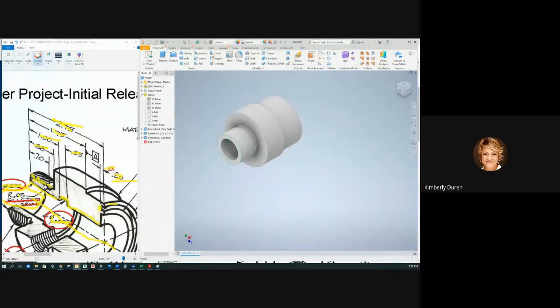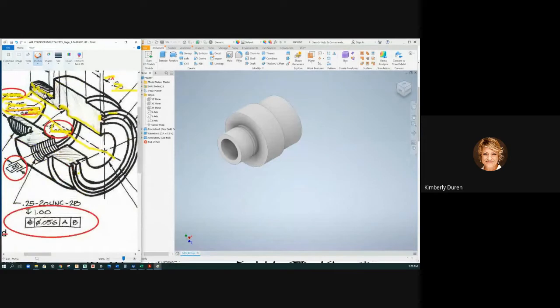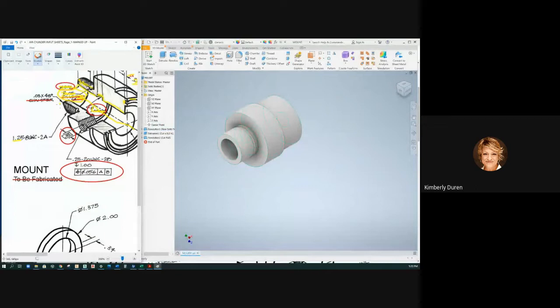Okay. So we've gotten our fillet of groove in and got our groove on. We're gonna knock those out. I'm gonna scroll down. Let me zoom out a little bit. So now we have a thread, and it doesn't matter if we put the thread or the chamfer in here because we don't have a distance. It goes all the way to the filleted groove. So you do want to put your filleted groove in first, but now I'm just going to put in my thread. Always do the thread before the chamfer, and then I don't have to think about it.